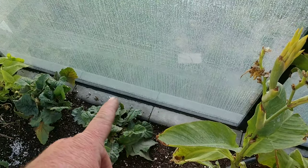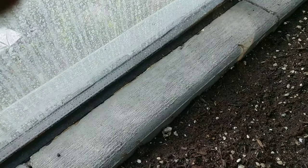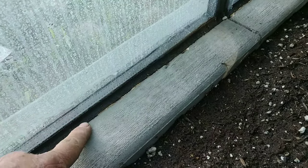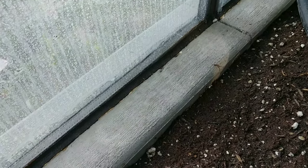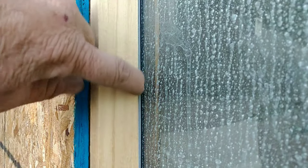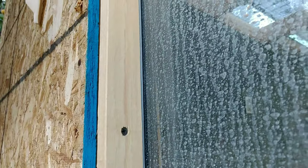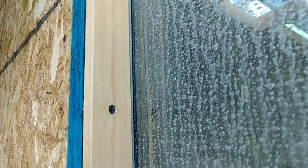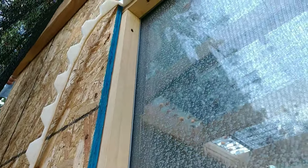After we put these windows into the groove in the concrete, we used a bunch of cheap caulking to fill most of the gap and then put roofing caulking — this black asphalt-based roofing caulking — around the whole perimeter. I probably should have masked that a little bit better. I'm not in love with it, but maybe you can find a regular black silicone if you do the same thing, or alternatively you can do it with white — that would look fine too. On the trim piece where the window presses against, I got some common gasketing from Home Depot for doors and windows. It has an adhesive on one side, sticks really well. You just put a little pressure on it before screwing in the inside part to hold it in place so you have a watertight sill.